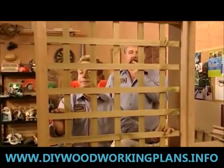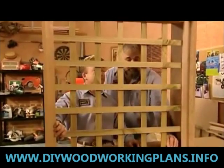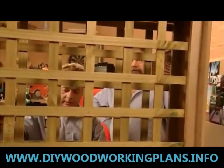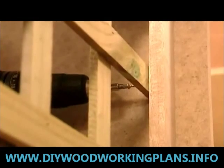When trimming the pieces, select one for the back of the wine rack to fit so that the horizontal frames of the lattice will line up 30mm lower than the horizontal battens on the front piece of lattice. This is to allow your bottles of wine to sit flat.